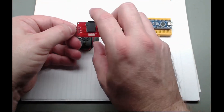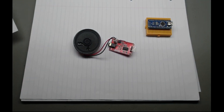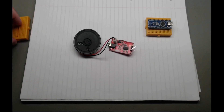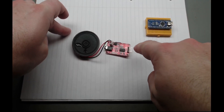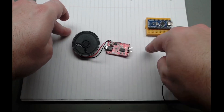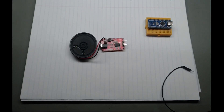This has four pins on it: receive, transmit, VCC, and ground. Now, a trick for the beginner here - and it's caught me out many, many times myself, even though I've been doing this for a while. If you're connecting a wire between one of these and one of these, the receive on this goes to the transmit pin on here, and the transmit pin on here goes to receive. So basically you've got to swap them over. You don't put RX to RX and TX to TX, like I've done many times in the past, and then try to figure out why the system wasn't working properly.